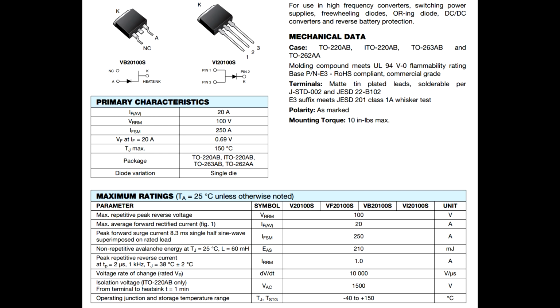And you can look at the actual diode used here as well and look at its maximum junction temperature right down the bottom there, plus 150 degrees C. So once again, it's actually going to be higher than this. If our heatsink's already at, well, 161 and not with any airflow over it, but you've got all these junction to case, and then the vias going through, and then the thermal resistance of the insulating conductive pad in there, the thermal pad, and everything else. It's just, no, it's really borderline.